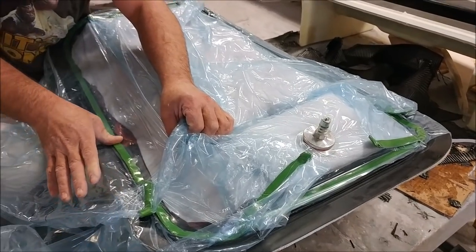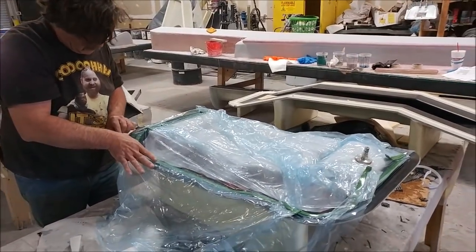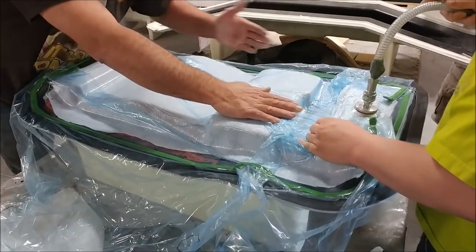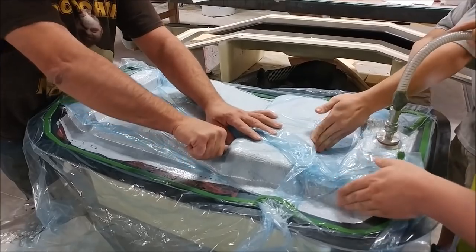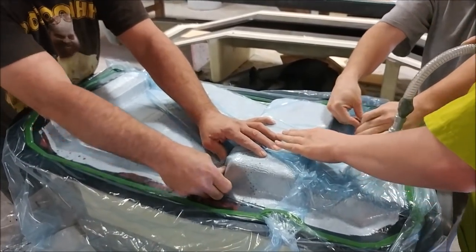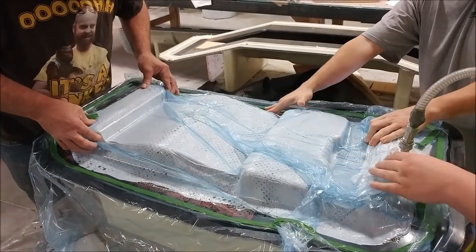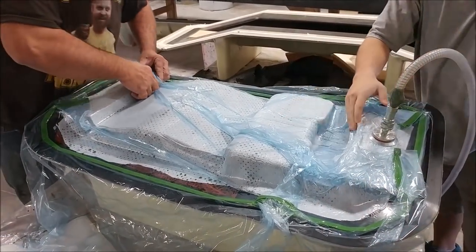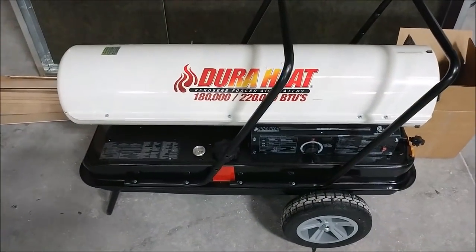Here's the first of the gear brackets — Jeff is laying up the bag and getting it all nicely sealed prior to hooking up the vacuum. He's being environmentally friendly and reusing a bag from before. Now it's under vacuum and drawing nicely. That mold has multiple parts — about four parts in that one mold — so come Monday we'll be able to release those, get them trimmed, and that's one step closer to having everything ready to start bonding all the fuselage stuff together.